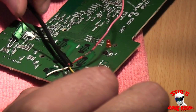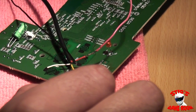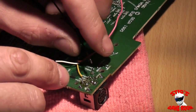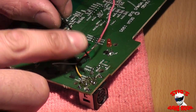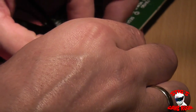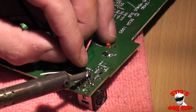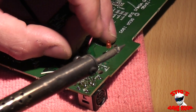What I actually did here was, rather than committing to splitting this main wire open — because I don't know what length I want it — I've actually put a couple of extensions on here to go across to the other side of the board. So I have my earth wire coming off the main cable, and I've put a bridge on it which is going to go across to the other side of the board. We'll just solder the earth wire in here. Okay, that's our earth in.